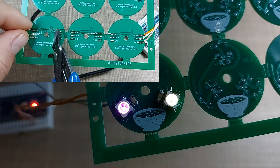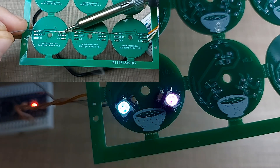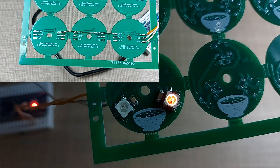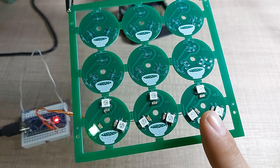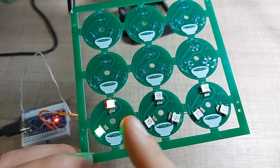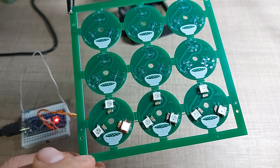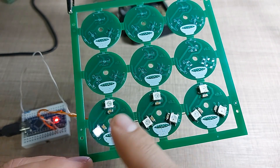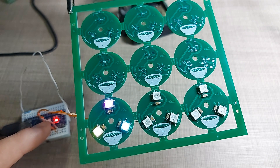This hopefully confirms the design we did for the board works. The next thing to try is soldering the rest of the boards and connecting multiple boards in series, to confirm that the output of one connects properly to the input of the next — because that's how I plan to drive them in the final project. Here are three modules finished. I've soldered two more and connected them on the solder pads at the bottom, so the output of the first goes to the input of the second, and so on. I'm hitting upload now with the LED count updated to 9.